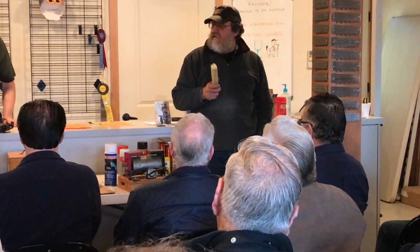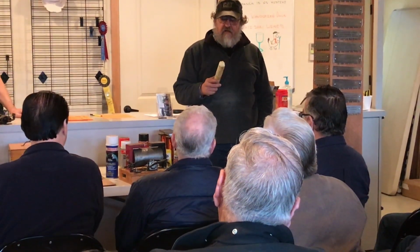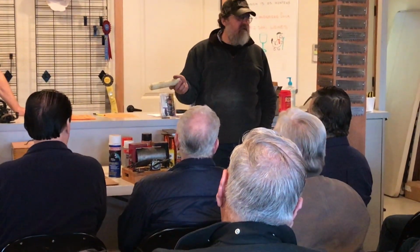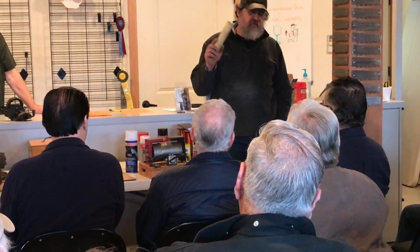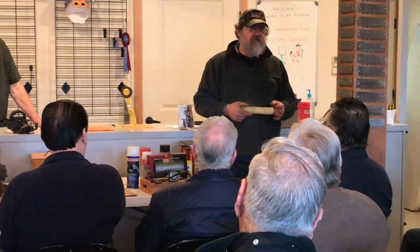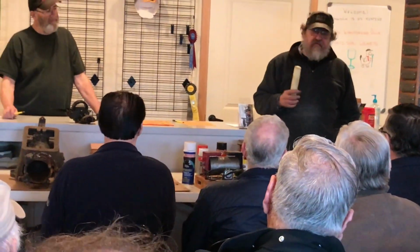Stinky stuff. Yeah. This is wax that I got from Wes that they use on snowboards. What I do, if I have a nut or a bolt that I can't get loose, you heat it up, put the wax on it, the wax will seep down into the threads and act as a lubricant. And 9 out of 10 times you'll be able to unscrew it.